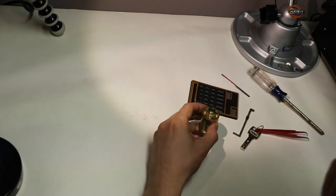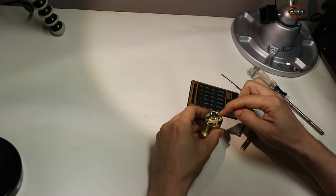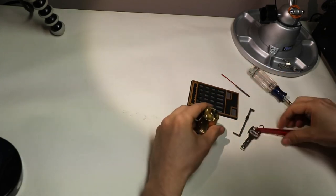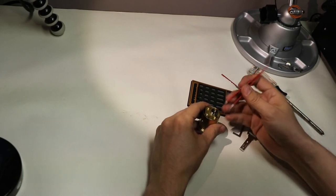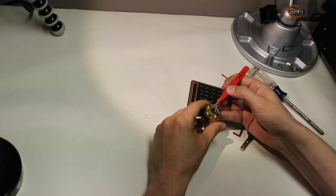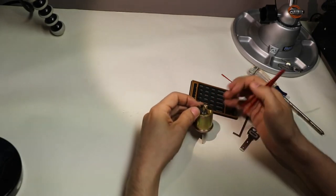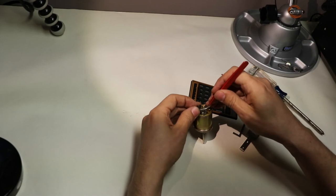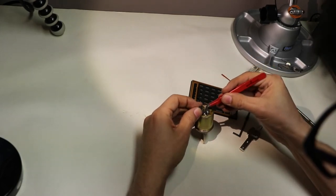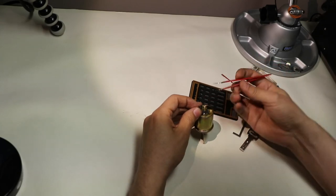All right, so that's side number 1. And what I'm going to do is rotate this back around the other side. I'm having the bottom face toward the table so that none of these little things drop into unknown holes and stuff like that. I'll lift the core up so that this bottom falls out, and I'll grab it on pin 7 because I know there's nothing in there. And then I'll start to pull up. Pin 6 has something, and I just lost it down into the keyway. There, number 6 on the right side, a little spring.